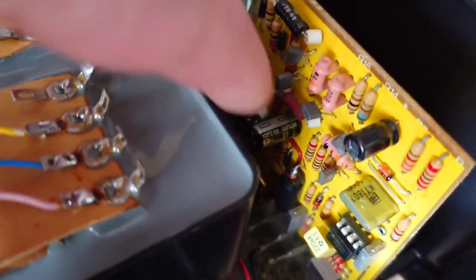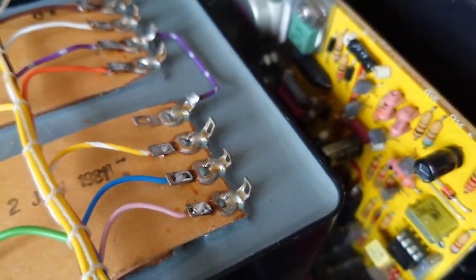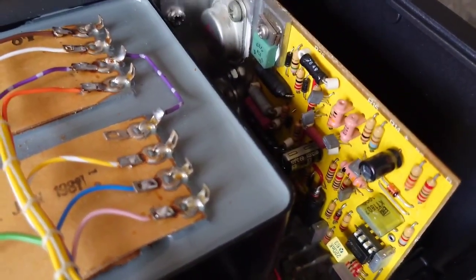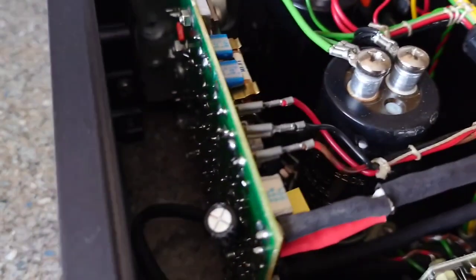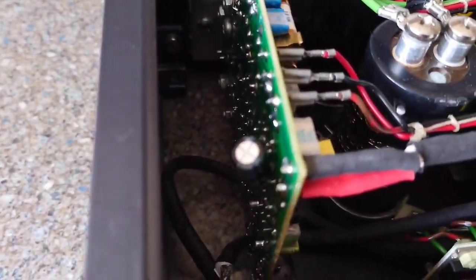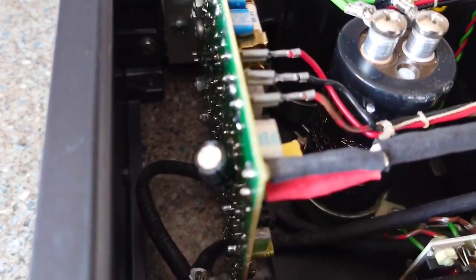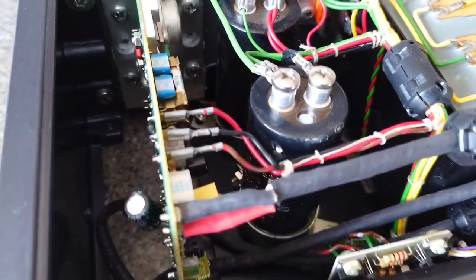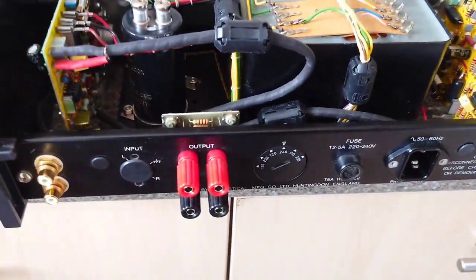This is one here and there's one down there as well. Then we've got 200µF by 25V, and you can see there's one on each board. I also need two 47µF by 35V capacitors.